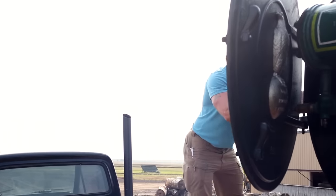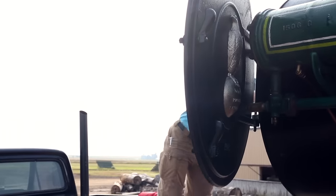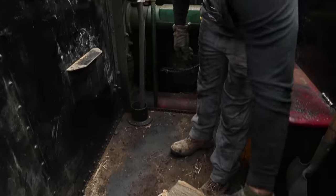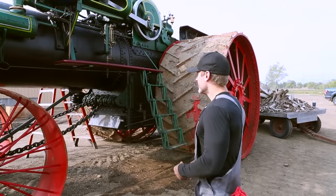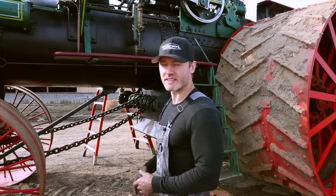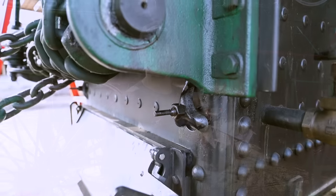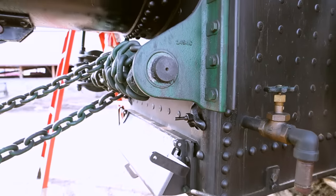My brother Scott is punching the tubes right now — it's a long process. The first thing we do with the boiler is fill it with water. There are six hand holes, which are clean-out and washout areas in the boiler. These hand holes have a gasket, and we put them all in to close up the boiler. We're running 180 pounds per square inch of steam pressure, so everything has to be sealed up very well to hold that pressure.